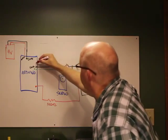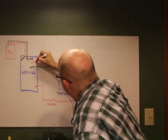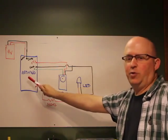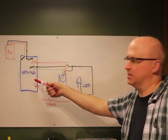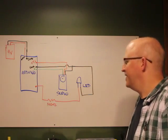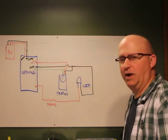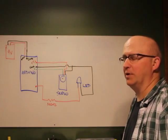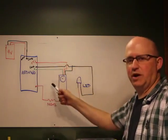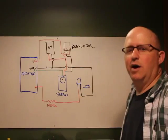If you try to power a servo from the Arduino Uno's 5V pin, it won't work. The onboard voltage regulator can only handle about 150 milliamps. On a Raspberry Pi or BeagleBone Black, which can consume up to 400 milliamps, you'd never get the board to run on a 9-volt battery. Also, powering everything from the same circuit means electrical noise generated by the servo will cause problems — it just won't work well at all.